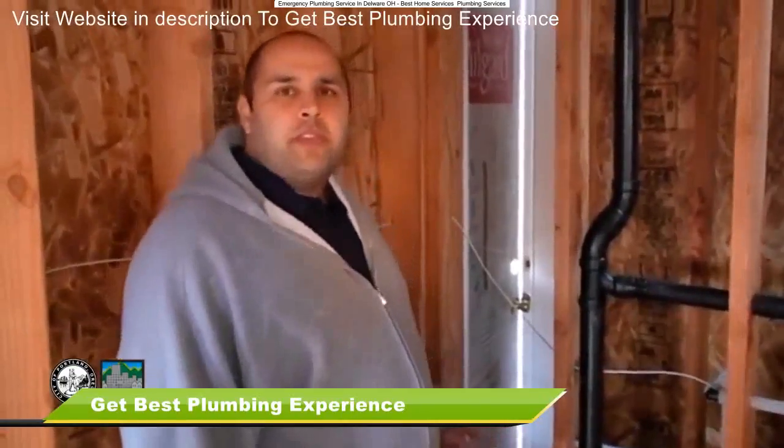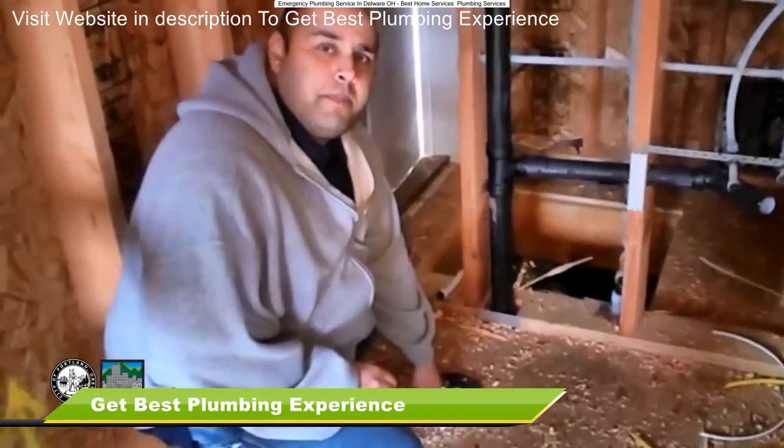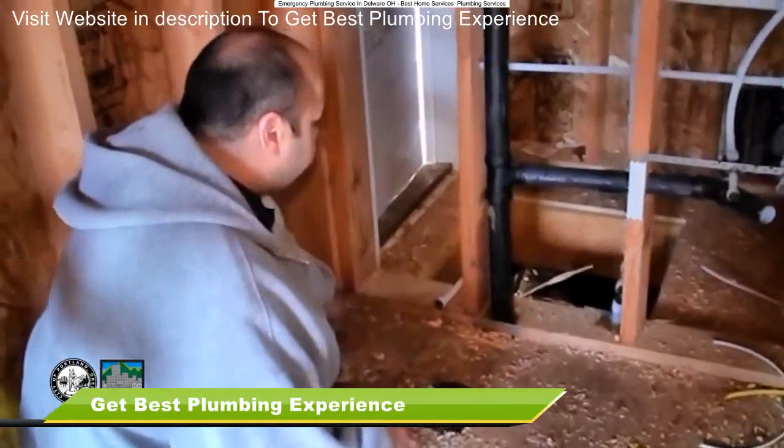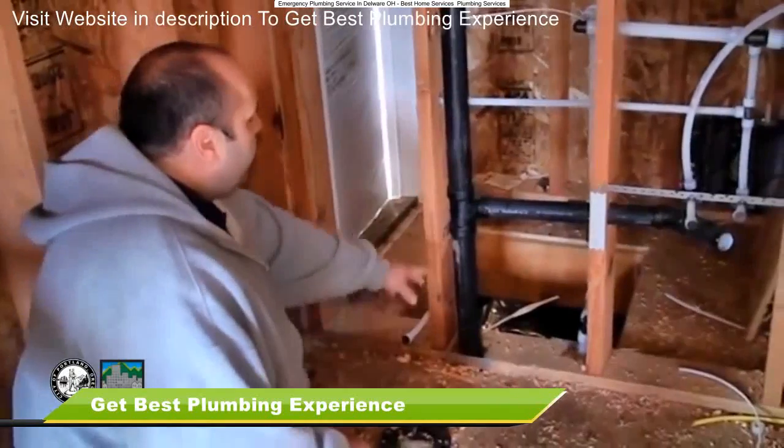We're here in the half bath of this home, and as you can see, we've got our closet flange here on the floor. We're going to start here. That takes a minimum 3-inch pipe. The flange should be secured to the floor. It needs to be 15 inches from anything on side to side of it. We're going to come back.